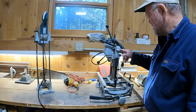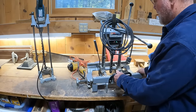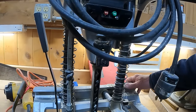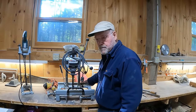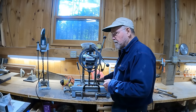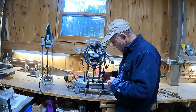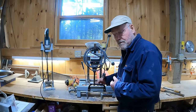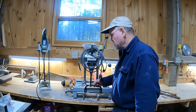And this is a square hole mortiser, right? This is a Makita 7305L hollow chisel mortising machine. These are pretty rare because they never shipped them across to the United States. I had to purchase this from a friend of mine in Korea, and he shipped this over to me, but I think now you can buy them on eBay. These are very handy tools. They cut an almost clean pocket that you don't have to clean out, versus a chain mortiser, where it's a rounded bottom and it's just messy.